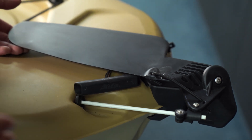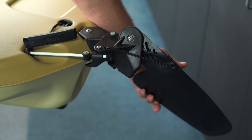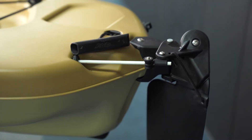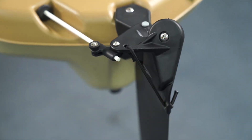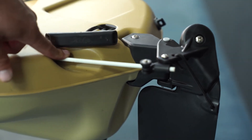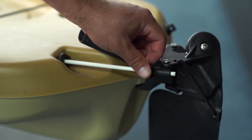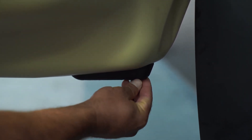This oversized manually deployable rudder is situated at the stern. The spring-loaded nature of this rudder allows you to partially deploy it before you hit the water, and then as you get into deep enough water for the rudder to deploy all the way, it'll do it on its own. The rudder has a ton of surface area and great articulation allowing for sharp turning in tight quarters. The rod goes straight up to the steering handle aside the seat for smooth and quiet operation of the rudder. If you need to adjust the angle, just loosen the knob a few turns and slide the rod through the rudder. The replaceable skid guard is sacrificial — as it wears out you can contact your dealer for a replacement, and it protects the hull from scratches on tough terrain like concrete ramps.